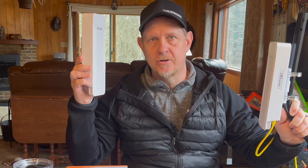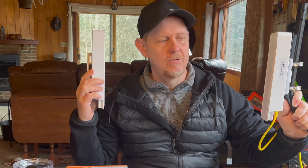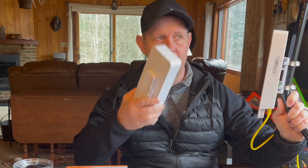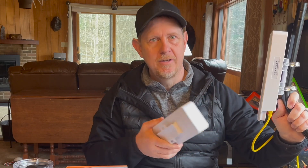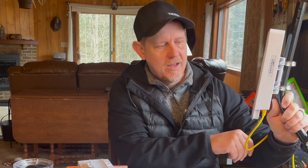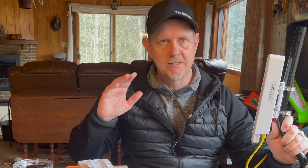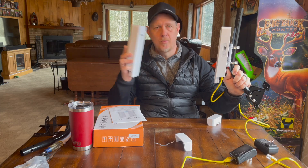This would be considered the master connected to the house where the internet is. Each of these would be the slaves — they would be the receivers of the signal. Then you come out of those into other devices. That could be a whole other building, where you come out and go into an access point for internet. You could go into a switch for one ethernet to many devices, or a router for different LAN systems. But the gist of this is: it replaces that cable point to point.